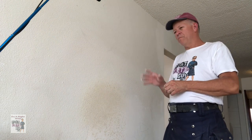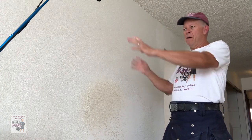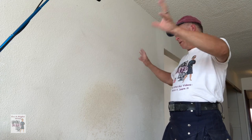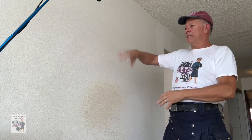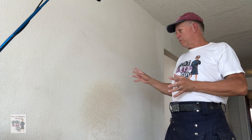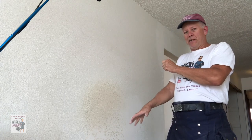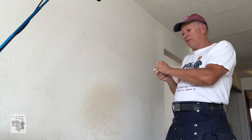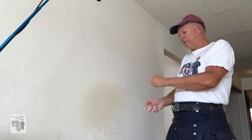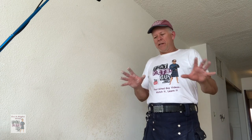Other than that, practice. If you don't have a scrap piece of sheetrock, put a piece of plastic on the wall, or some brown paper or masking paper — whatever you've got. Even I, when I'm going to spray one of these, usually have some masking nearby. I'll tweak my settings to where I think they should be, spray off to the side to make sure I'm in the right area, and then get to spraying. I sure hope that helps you out.